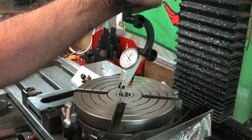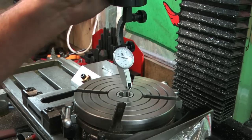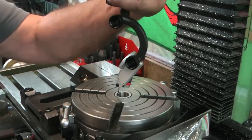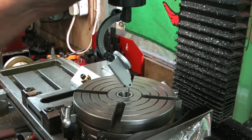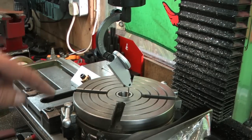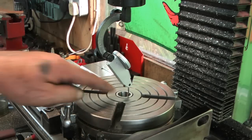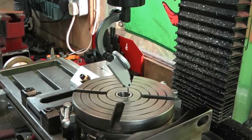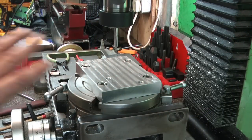I don't know how well you can see the clock face. I've just popped my rotary table back on here. There are far simpler ways of centralising the rotary table. About 14 marked there — I've got the same there, maybe 15 there. And if I pop it the other way, maybe about 14 there. Centralised enough. I've clamped down the rotary table square and I've just clocked up the central bore. So I'm going to turn my DRO on and just set X0, Y0 and then go to absolute and set those two to zero as well — all zeroes. Absolute and incremental, all zeroes. That's home.